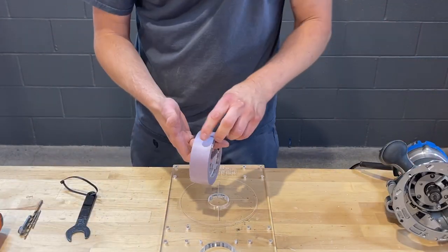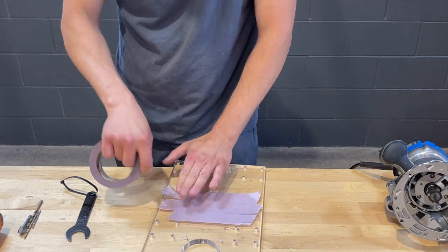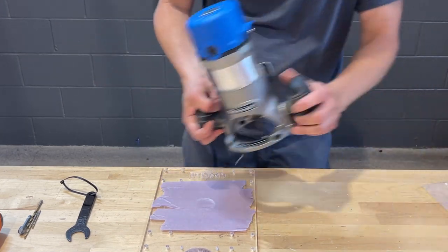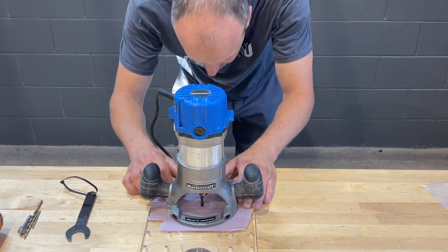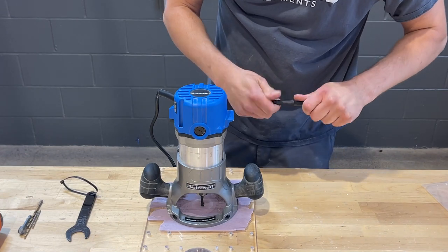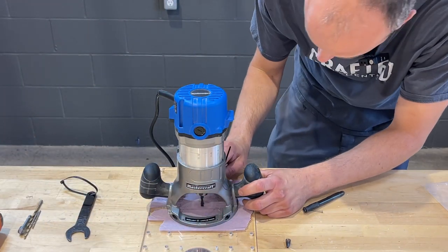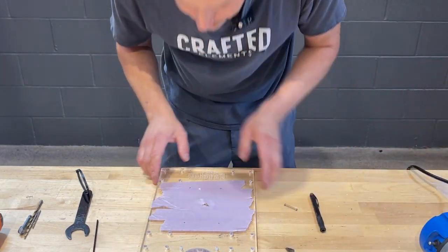Next, get some masking tape or painter's tape — this serves two purposes. One, it makes drilling into the acrylic easier so your bit doesn't walk away when you drill. Two, it makes it easier to mark your drill holes. I can still see the outline of the six-inch etching and the center through the tape — that's pretty close to center. Grab a pen; depending on the thickness of the router, you may want to take the pen apart and use just the internal ink tube. Then just go ahead and mark all your holes, take the router off, and set it aside. Now we've got our four holes marked.